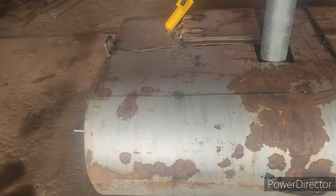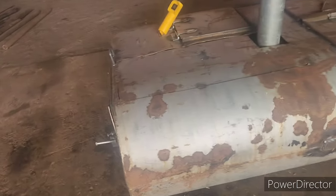So it's 3 inches. And I'm going to build a cage so that cows can't necessarily rub on it. So 4 legs. This is 4 feet from there to here, so it'll be 5 feet. The tank is 6 feet. So I'm going to make it 5x7 is my plan. And then 2'4" high. The tank is 2 feet, I'm just going to go up a little bit higher. The cows will have to reach basically 1 foot from out here to the drinker hole. That should not be a problem. If they come from the end, it'll be a little closer, but if they're on the side, it'll be a little farther away.